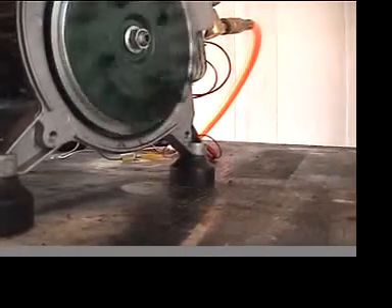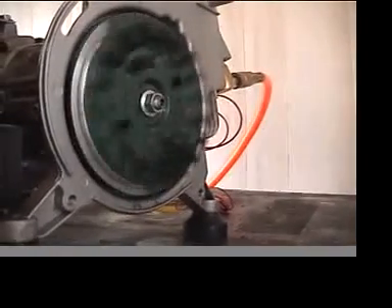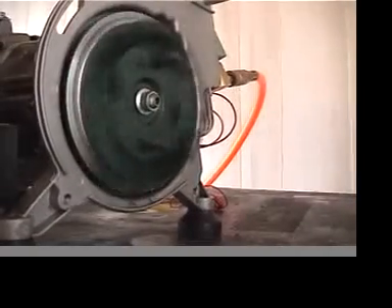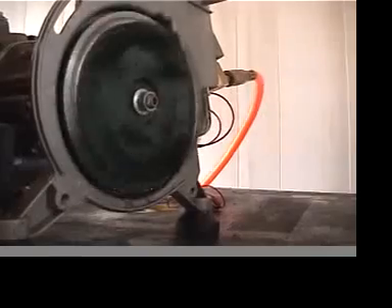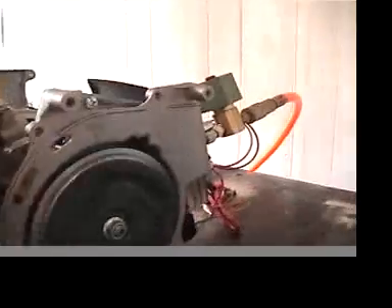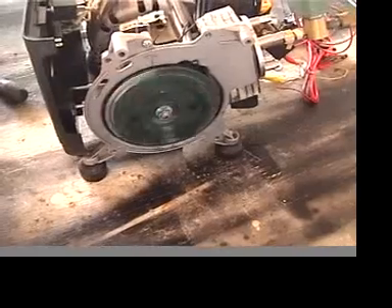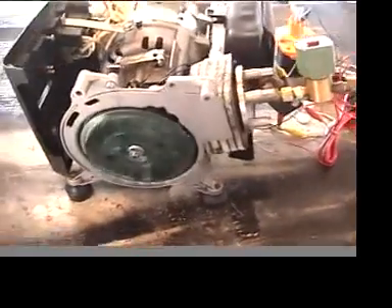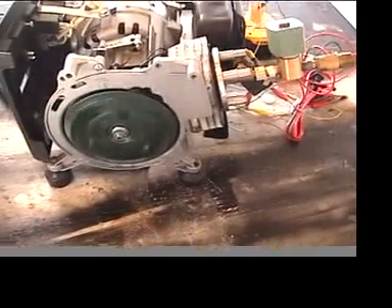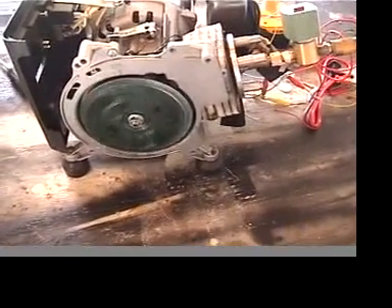Let's turn up the pressure a little bit. Now the problem is that the solenoid acts as a throttle, so not enough air is getting in. You need a bigger inlet. The exhaust is probably okay, but the inlet is going to have to be bigger. That's a quarter-inch 12-volt solenoid operating in about 50% of the stroke — it expands and exhausts.